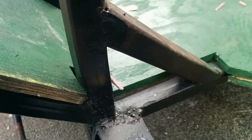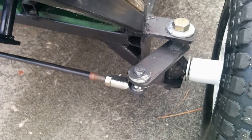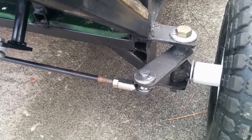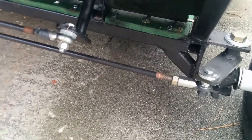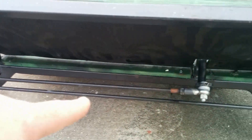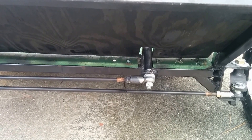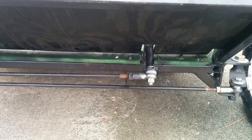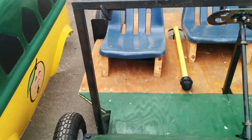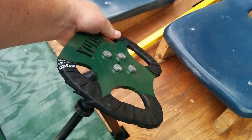This is a good setup if you're going to do something similar — it's just a 5/8-inch bolt welded onto 1-inch by 5/8-inch inside stock. We have our trailing arms and a really unique linkage system. We drive one of the wheels and have a bar that connects both of them, keeping everything straight and true while driving and giving us the most speed. We were a flying brick, but we were straight as an arrow with no driving issues. The steering is still solid — no problems.